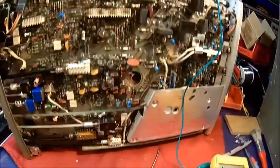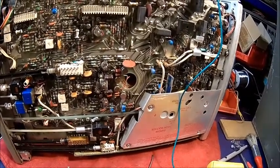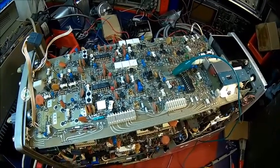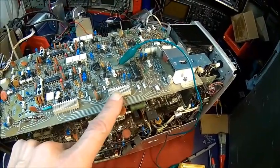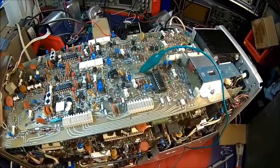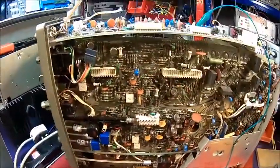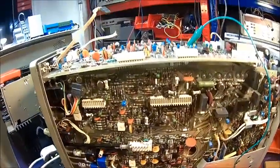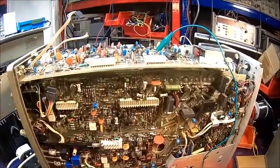We did a few checks on the voltages, and the minus 8V rail is completely shorted out — a solid short to ground. We pulled the board up to disconnect the connector, because the minus 8V is coming from this connector. The short was still present on this board, then I pulled all these pots out and it suddenly disappeared. So we may just have a short somewhere on this — maybe one of the connectors was the wrong way around. The broken wire on that pot also needs to be fixed.